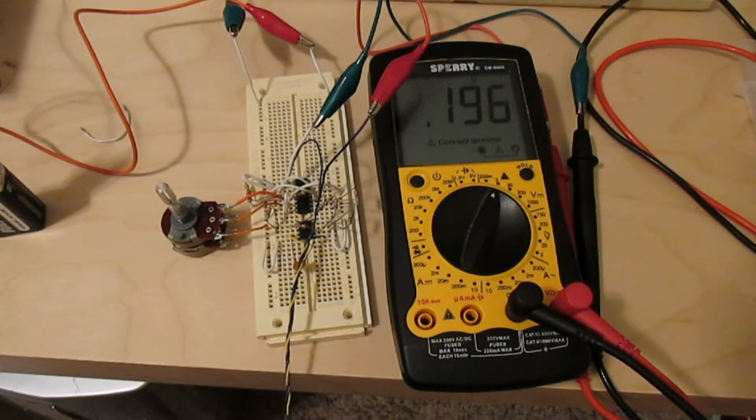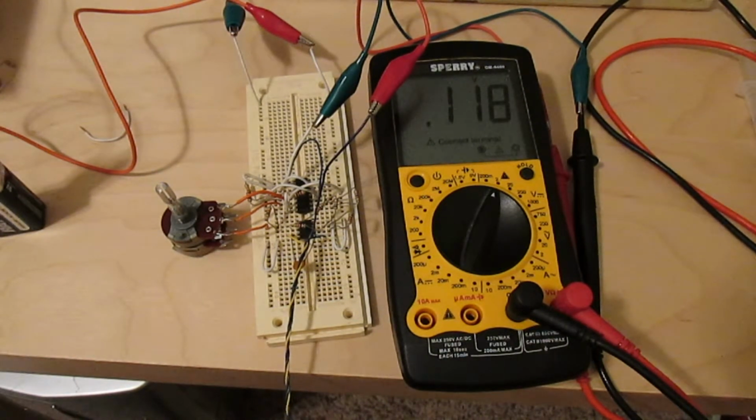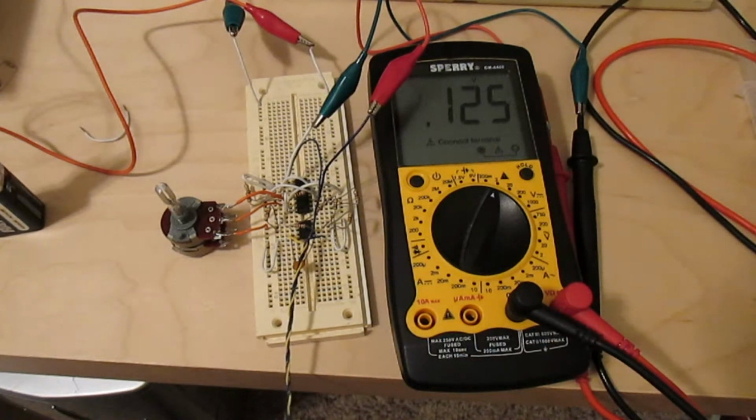So now that that's all calibrated, I've got the pennies taped on. And when I push on them, I can sort of change the DC offset around as I'm changing the voltage on each of the electrodes. The worst I've seen so far is about, yeah, right there, about 220 millivolts. 240 is pretty bad. Keep in mind this is also going through a gain of 3 at the front end, so 240 millivolts here is about 80 millivolts. Alright, so this gives me an idea of roughly how bad I could expect the DC offset to get.